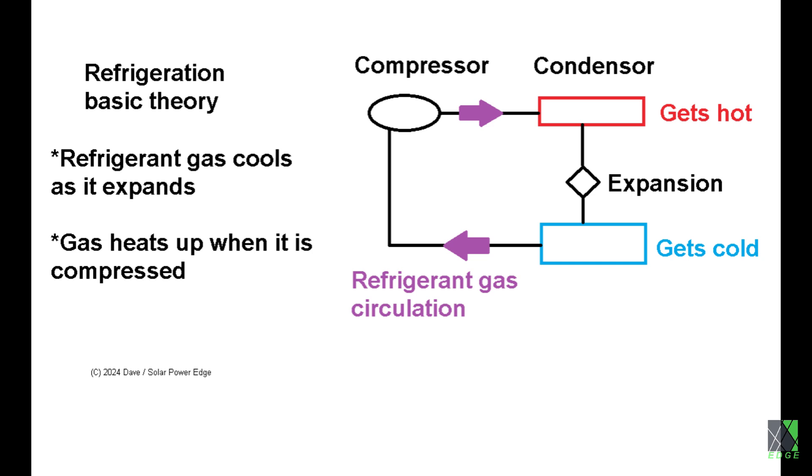Here's a quick look at how refrigeration works in theory. Basically, as a gas expands it cools off, and when it's compressed it heats up. You take a compressor and compress the refrigerant gas to high pressure, push it through a condenser like a radiator to blow that heat out, then run it to an expansion valve which causes it to expand — all of a sudden it gets very cold. You blow a fan over it and that makes cold air. The gas then goes back into the compressor and the cycle starts over.